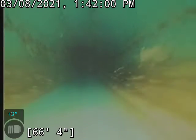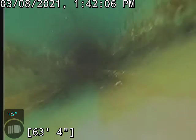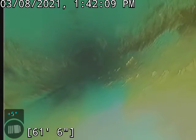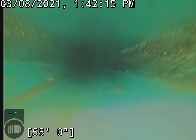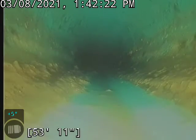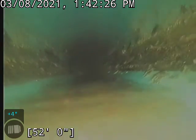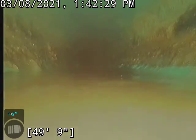There is minimal sludge — that's basically all I've been seeing in this line. I'm going to recommend that we use our chain knocker machine to get that sludge knocked off the walls, and I'm also going to recommend a Bio One treatment. That is a live enzyme that gets into the line to help prevent future sludge from collecting — just preventative. There's a little bit of a belly here.